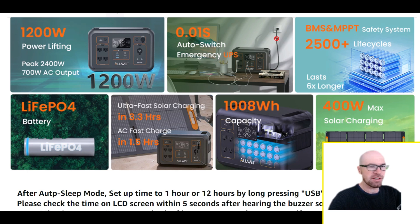First, the capacity — they're still using the same case, which is interesting considering the number of updates. It's now 1008 watt-hours, whereas the old NMC version was 1132Wh — slightly less. It does weigh about five pounds more even with less capacity, but that actually demonstrates the improvements we've seen with LFP cells recently. NMC is still lighter with better energy density, but it's getting close. I was surprised they fit 1008Wh into the same case.